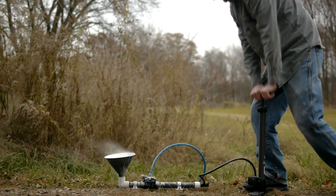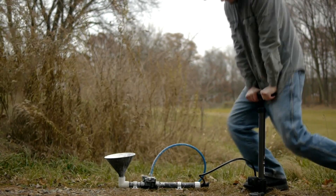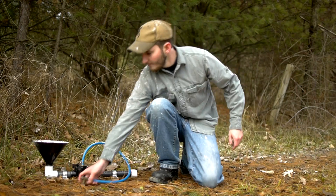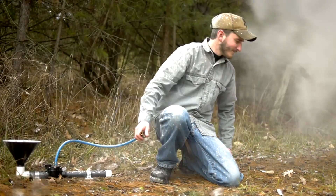Now when the air tank is pressurized to around 60 PSI, anything that is loaded into the funnel will be thrown out as a simulated explosion when the ball valve release is opened. It's quite safe when loaded with cornstarch, though it can be messy on a windy day.